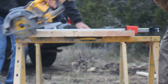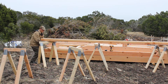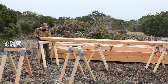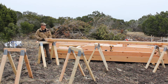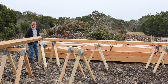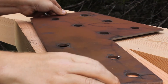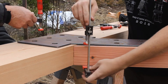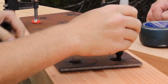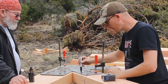Once that was done, we carried the big beams over and put them on top. Even then they weren't laying up perfectly — everything was twisted one way or the other just a little bit, but they were close enough that we could get the plates on, throw some clamps on, and bring everything together to mark our holes accurately. What we found when putting these things together was that modeling in SketchUp and printing out that cut list worked out really well. I didn't have a single piece that had to be recut because it was too long, too short, or the angle was off.